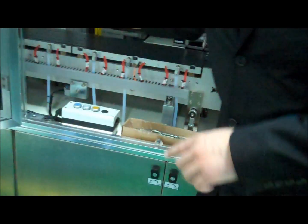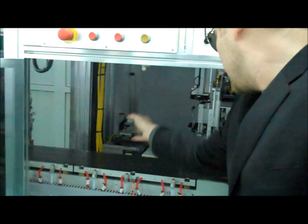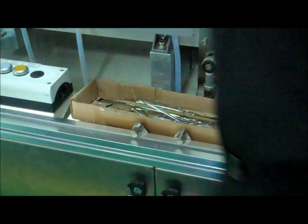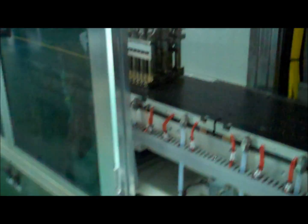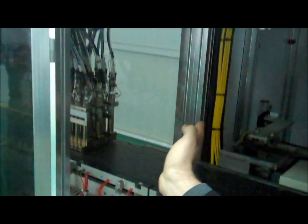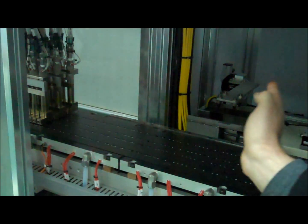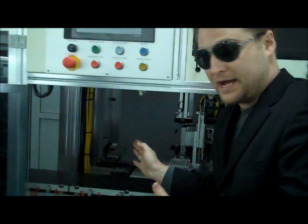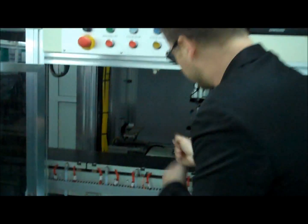This is where it heats up the wafers and then they put the soldering on. It drops down here and these are the soldering sections right up here with these strip types. This is the soldering, the aluminum, and then this is the system. It will move slowly and very accurately solder this so that the efficiency — the amount of panels that are bad — is minimized with this system.